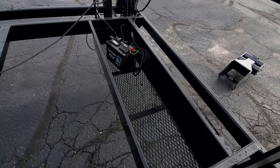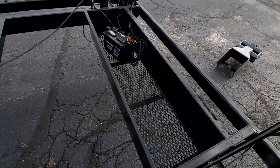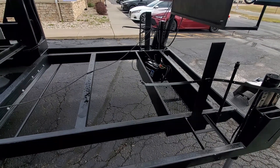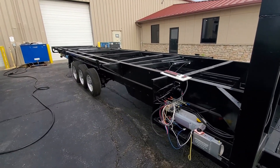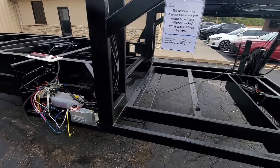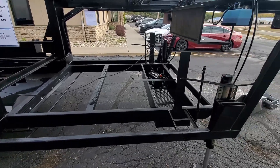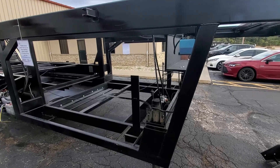Typically with lithium batteries, especially with larger battery banks, they get put into the main compartment. The reason is that the main compartment has heating supplied by both furnaces — there's a duct from both furnaces. All units over 40 feet have two furnaces, and both are ducted into the main storage compartment. If your battery bank is in there, it will never get below freezing. This matters because if you charge a lithium battery below freezing, you will destroy it — immediately and completely, non-recoverable.